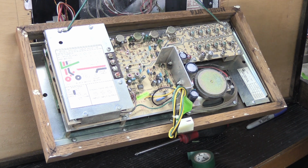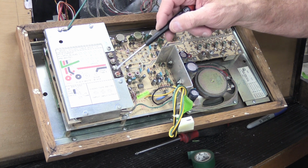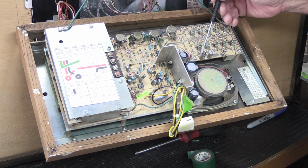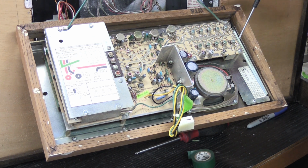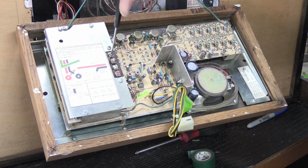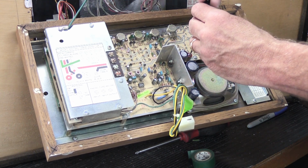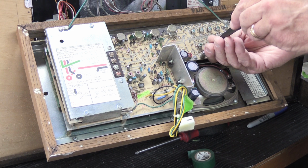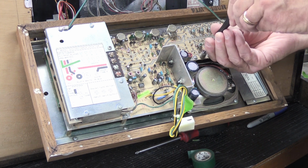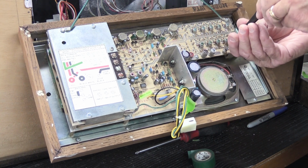Before we lift it out of the wall, one last small thing to do. We backed off or loosened a bunch of screws. We loosened the screws for the antenna. We loosened the screws on the binding post, the door speaker, black wire, and the 5 screws for the green wires from the remote stations. If you're going to be packing this up and sending it somewhere to have it repaired, it's a really, really good idea to lightly tighten back down the screws, especially the screws on the 3 binding posts, because they have a really bad habit of being jostled around during shipping and falling out.